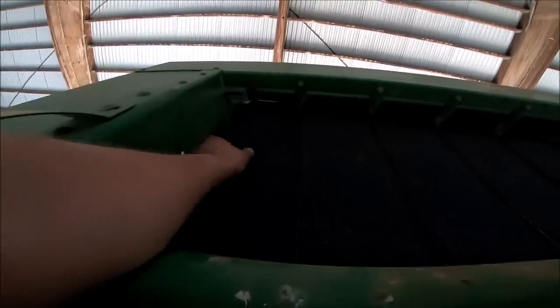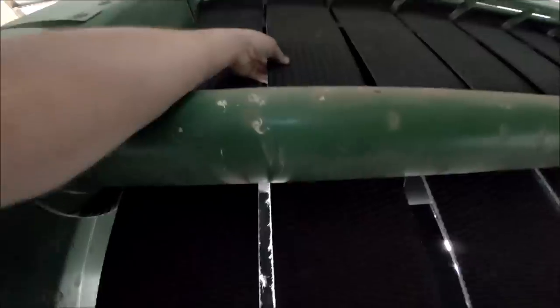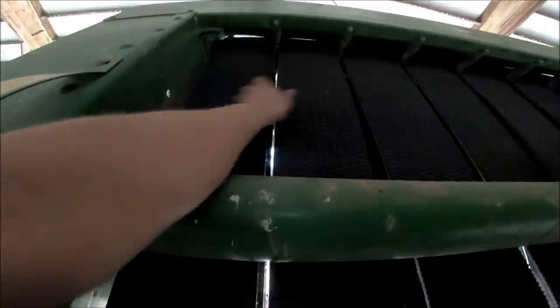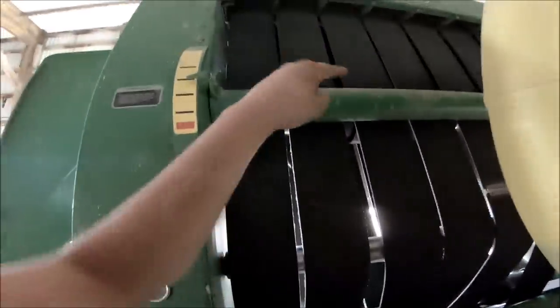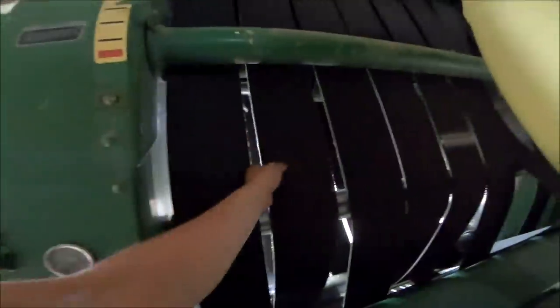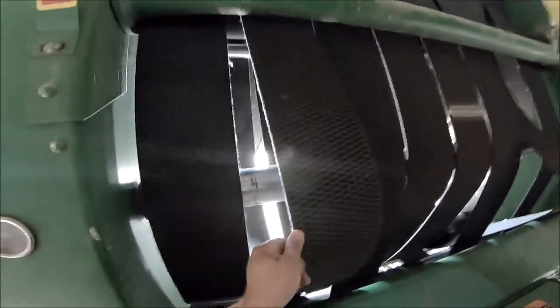These spacers up here are missing on this one - that's what destroyed my spacer. The belts were able to overlap. When you go to shut the end gate or you're starting a bale, it keeps these belts running true, but when you're on a hillside the belts like to overlap and try to chew into each other. You can see we've had issues - we're missing some rubber right there. This got flipped over, and I can tell you how to know the difference between dust and smoke: smoke comes out gray. I had it smoking up on top.